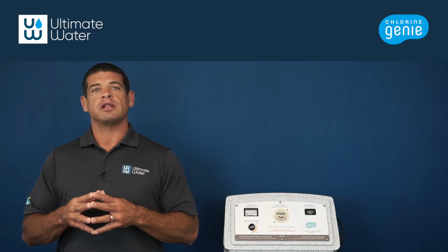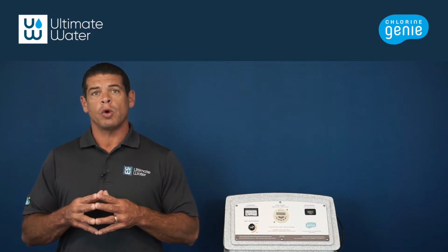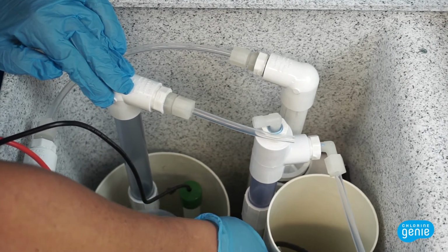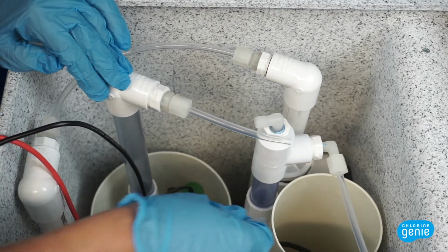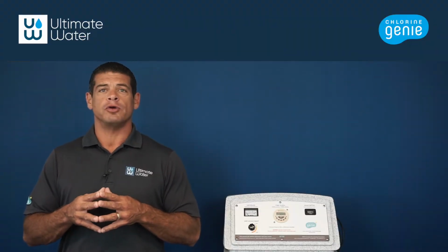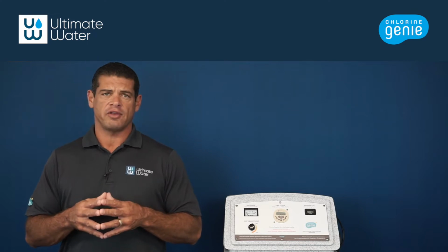Be careful not to get the liquid from the anode tube on your skin or put it in your eyes. Pull the cathode tube out of the 4-inch precipitation tank to free the cell. Again, take care not to get liquid from the cathode tube on your skin, your clothes, or your eyes.